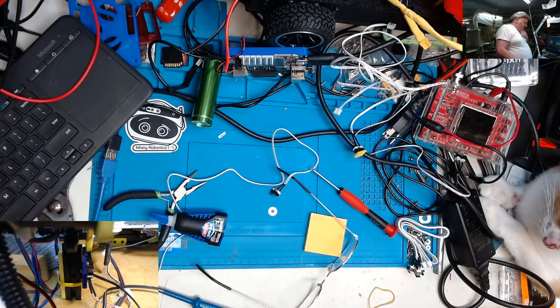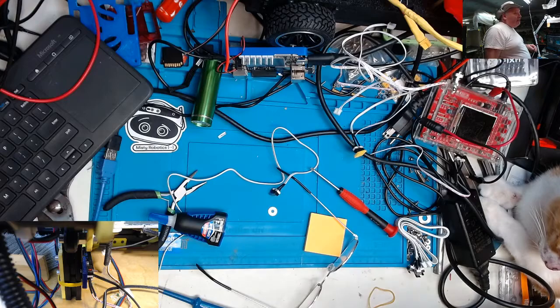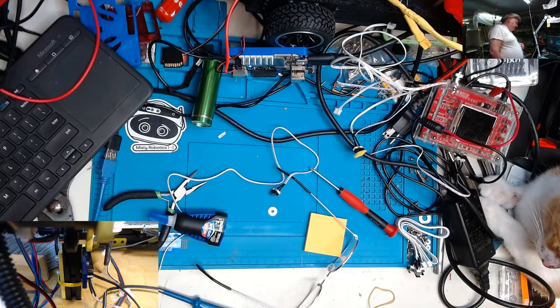And I'm thinking I might just be able to put a big old blob of solder right there, get it hot on the other side, and just solder the two pieces. Because there's very little force going on this switch, right? Very little force, and only ever so often. Right at the very beginning, or only when you auto home does it ever really get hit.